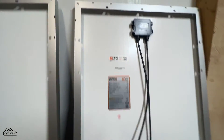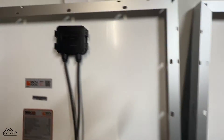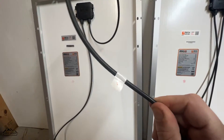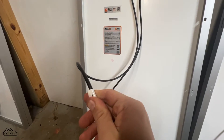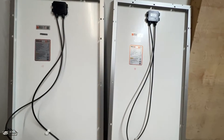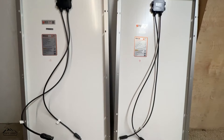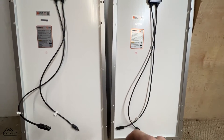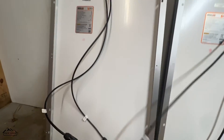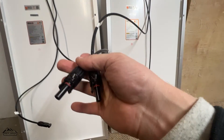With all of these panels you can see there's a negative and a positive on each panel, and on the leads red is positive and black is negative. In series you connect the positive of one to the negative of the other, making a daisy chain. In parallel it's the opposite — you connect the two positives together and the two negatives together. You may be asking: how do we connect two positives together? In this row we have two males and they don't connect into each other.